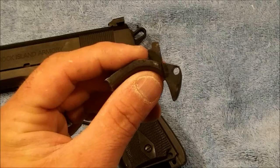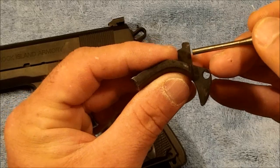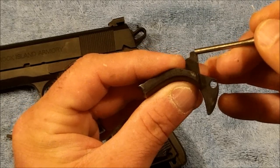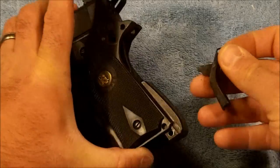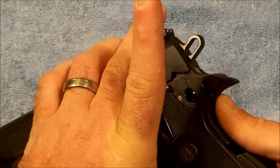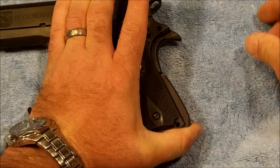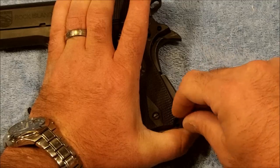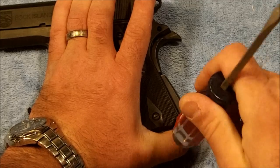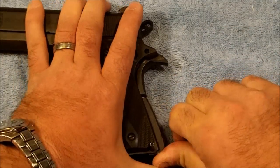The user that had asked me about it had mentioned a post where they had actually shaved down this arm ever so slightly on the top end. What that did was allow the clearance to rotate that out with the mainspring housing and put it in place. My response to him was I had never tried it before, but I thought it might be possible depending on the pistol.